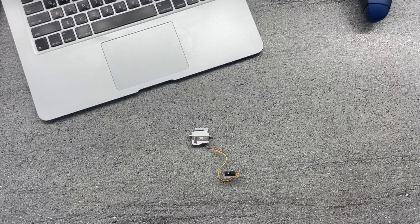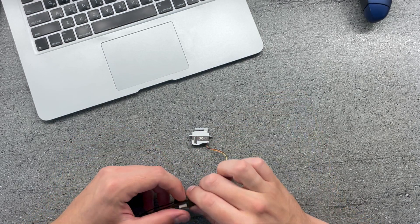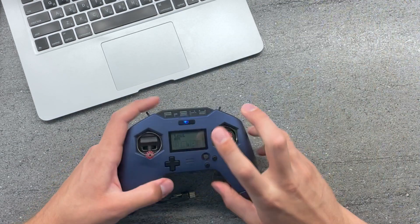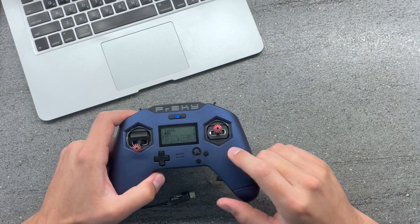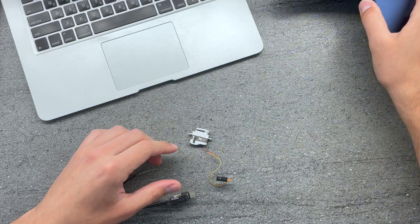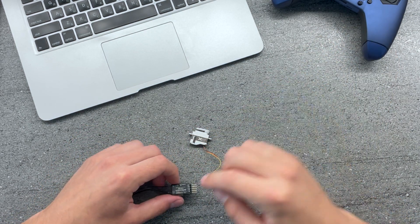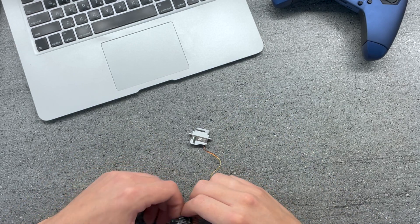Now let's go to the cool part. As I mentioned, this servo is programmable, but at the same time if we plug this into the regular PWM output of the receiver it will work as well. To learn more about how to program the servo, we'll need a few things. First of all, we'll need an FrSky radio — in my case that's a Frsky X-Lite Pro with the latest OpenTX firmware, or an Ethos radio with a color screen, in which case you can skip the Lua script part because it's built-in. And in both cases we'll also need an FrSky Access receiver and the Lua script downloaded from the FrSky website. FrSky Ethos radios have this script already built into the firmware, so you don't need to upload anything extra.